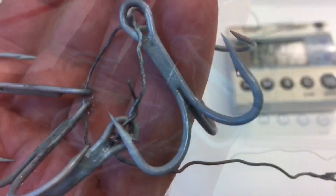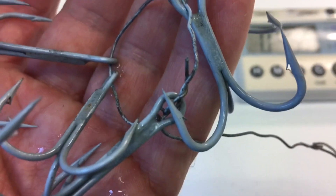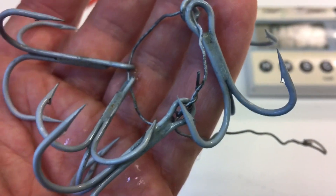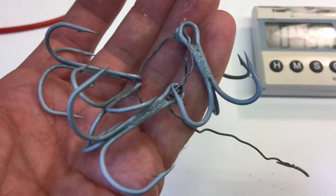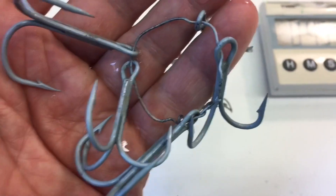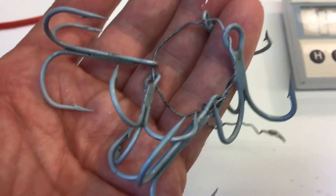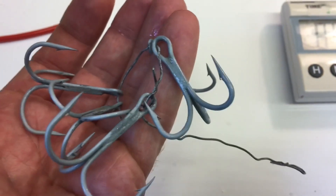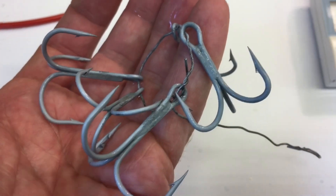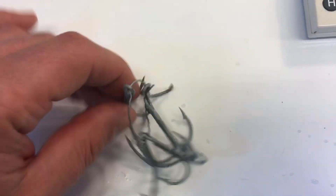These are my galvanized fishing hooks — now these won't rust for 20 years, because I put on about 20 microns thickness of zinc. That you have to calculate. Theoretically it should hold, and maybe you run off about 0.3 microns per year. So there's just a little bit of polishing left to do.